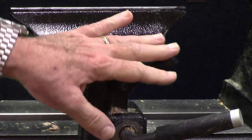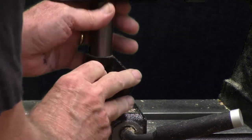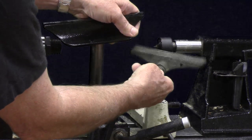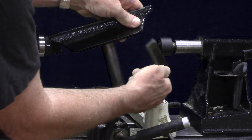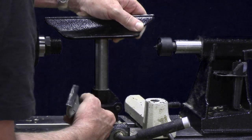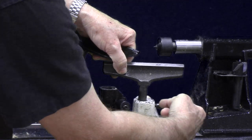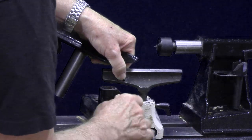Besides the overall appearance, one of the things that caught my attention most was this 1-inch tool post. If you compare the 1-inch versus the 5/8-inch typical of midi lathes, you can see there's a substantial difference. Also, the tool rests that generally come with most midi lathes tend to be quite a bit flimsier. This one also doesn't have this clamping mechanism — it uses a locking mechanism that drives a pin in, and it just doesn't hold nearly as securely as this clamp.